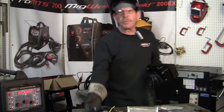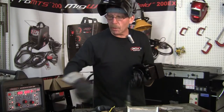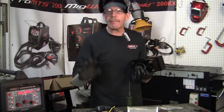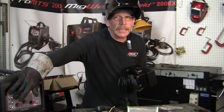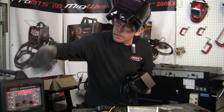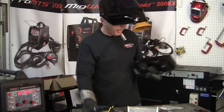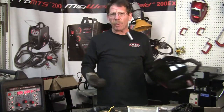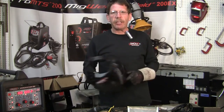That's how you use the stinger control. When you want to use the foot pedal, just plug it in the same spot — make sure the stinger plug is safely put away. Then just switch from 4T and your second program will already be there, so you don't have to mess with any other controls. That's your DC. The next one will be AC, and I'll show you how to do that including the pulse settings. I'm Rob. We'll see you next time — Longevity Learning Lab. Bye.